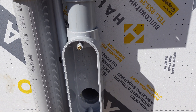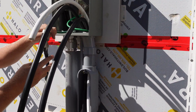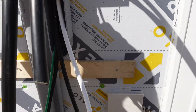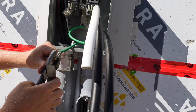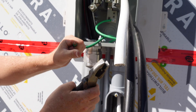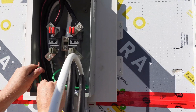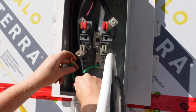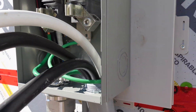We're putting the bottom of the secondaries up into the meter first, tying those on and leaving them hanging out the LB — that makes it easier to tie those big cables into the bottom. Luke is stripping a piece of number four wire, which is the bond between the metal casing on the meter and the panel inside, and that's going to go right into the back there.